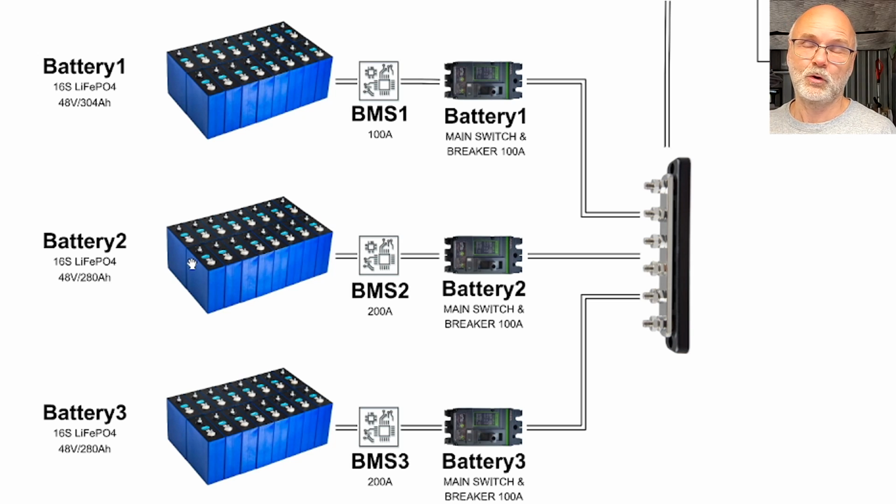And I have used Paul's aluminium bus bars here to connect all these batteries together. I have not polished, I have not sanded, I have not treated these terminals in any form. The battery came like this out of the boxes into the shelf. I've connected the aluminium bus bars. There's no paste, no grease underneath, nothing. And it just works totally fine.